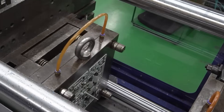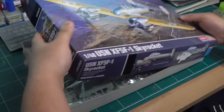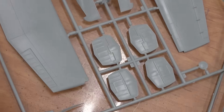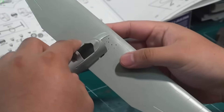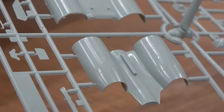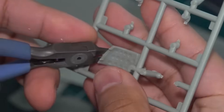In order to do batches well, we actually have a solution already from the injection molding industry. If you've ever built small plane kits, you get a card full of all the pieces and then snip them out and put the plane together. That webbing of support material is something you can apply inside of 3D printing. Only 3D printing has an even better option — instead of using sprues that have to be snipped off and leave burrs on the parts, we are going to use a raft.